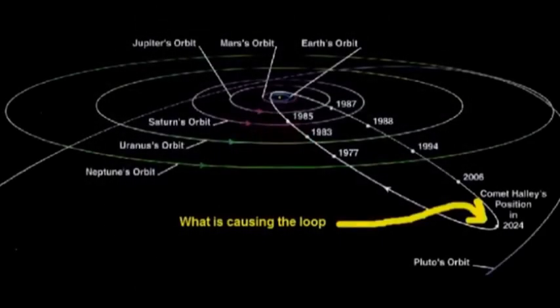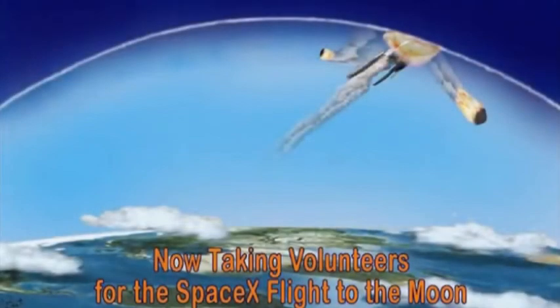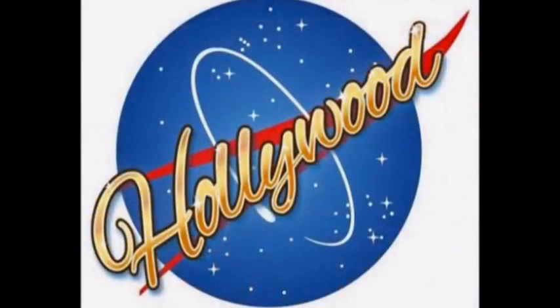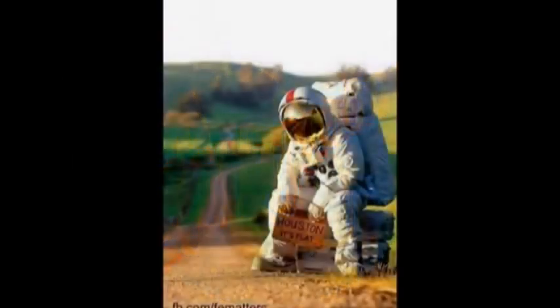So anyway, when you get into that high, those other types start to become no good, because the permeability of them, they just won't handle it. So what they actually have to do is go to soft metals. They'll use like a copper ring, and they also use silver. Interestingly enough, the copper melts at 1984 Fahrenheit. Silver melts at 1763.